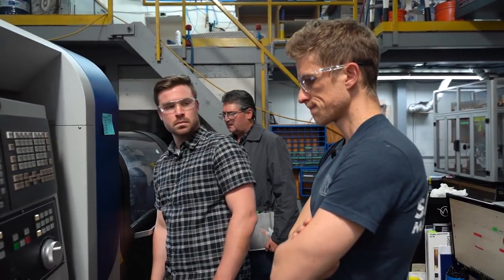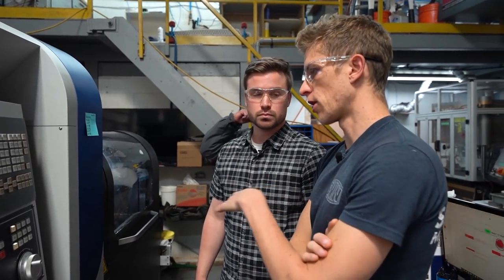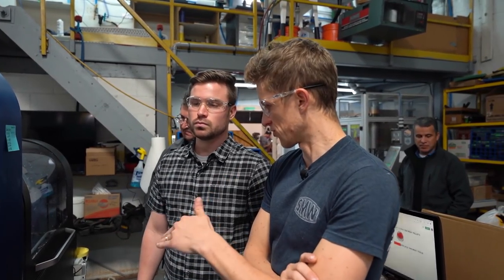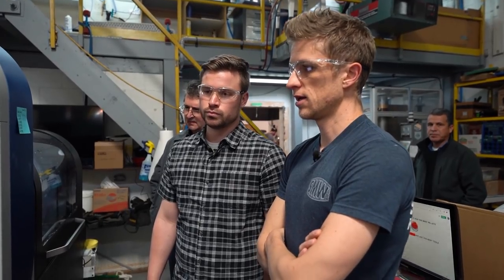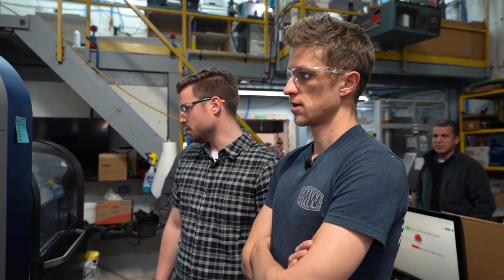And other than that, it's basically... If you're making a good part with the tool that's almost worn out, I don't know if I would switch to the next tool without measuring parts. If you're trying to hold like a tenth, I would definitely want to baby that. That's me and experience. With experience, you might find it's fine, right. But no, we definitely have somebody monitoring it.